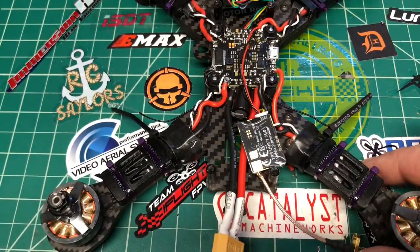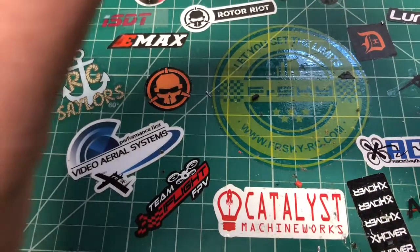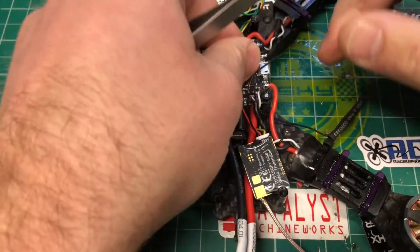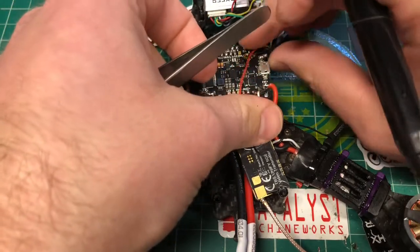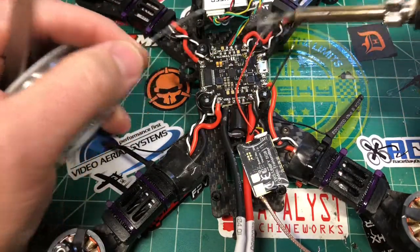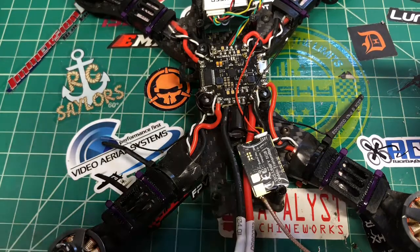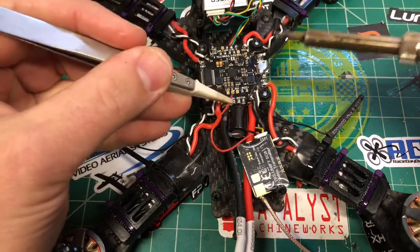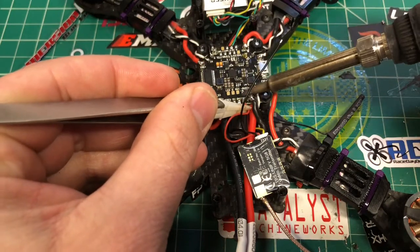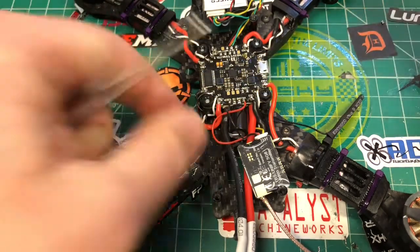So audio is red, so the red is going to go to the TX4, and you have to set all this stuff up in Betaflight. He's got a really good manual on how to set this up completely, so I'm not even going to go into it. Why talk about it when the maker and professional has already done it? So you can check that out. I'll leave the link below. You can get to the manual, set up smart audio and all that good stuff. So red is going to go to TX4 because that's where the smart audio is connected. And then black is going to be our video. And that's going to take the video from the board to have the OSD.